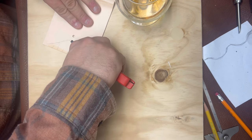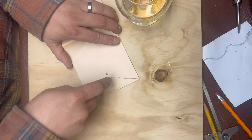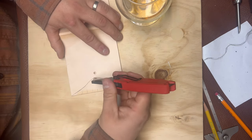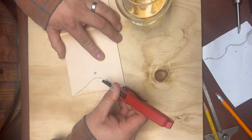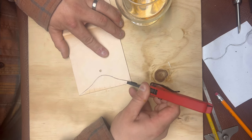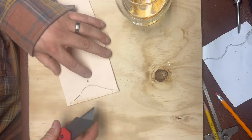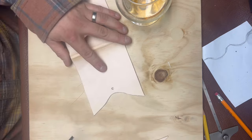I'm starting in the middle and doing a very light first cut, because you don't want to go running wild and end up with a cut that goes off into no-man's land. If you get real close to a line, the blade sometimes wants to follow the line you cut last time — and I just did exactly that. But we'll be beveling these edges anyway, so it's not the end of the world.